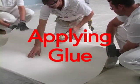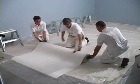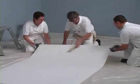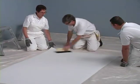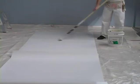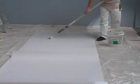Our installers are ready to apply the glue. The Egan Wall now requires to be unrolled paper backer side up. You must ensure the paper backer is free of dirt and dust. Our installers have chosen an appropriate glue for the installation. Starting from one end working 4-foot sections, our installer is applying the glue in a vertical W pattern. To ensure even coverage, our installer changes to a horizontal W pattern.